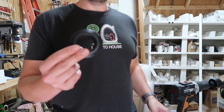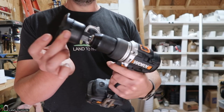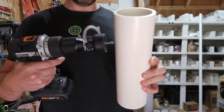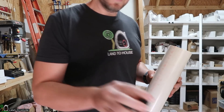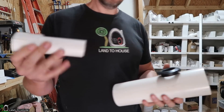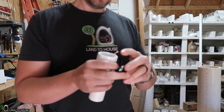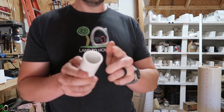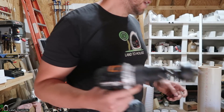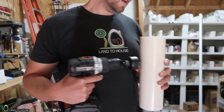So let's put this thing together, go up the mountain, connect everything, and hopefully have water into our hydro system. A Uniseal operates a lot like a bulkhead — you find a hole saw that matches up to the back, drill a hole into your pipe or tank, pop the Uniseal grommet into that hole, place your pipe in, and it flares out the back side of the grommet making a watertight seal. A lot of times you have to file down your pipe so it slides in easier. I just got this hammer drill and I'm going to put two holes in this pipe.